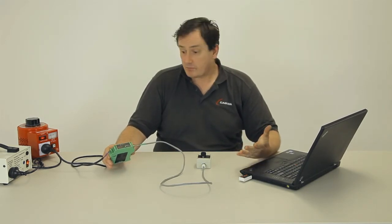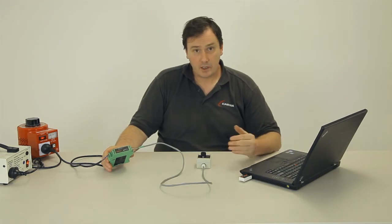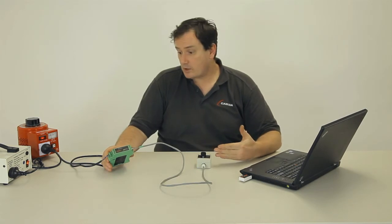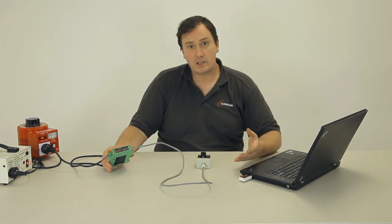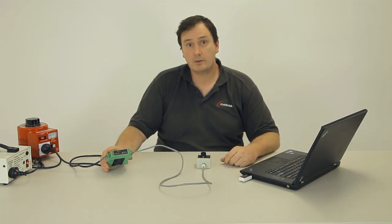Apart from that, that's it. All you've got to do, to go through it, is connect it, wire it up, make sure that your load signal is giving you a good range of input, zero it, calibrate it. If you've got an overload capability wired in, then set that, and lastly give it a name. And that's how you set up a lift log. It's pretty straightforward. Cheers.